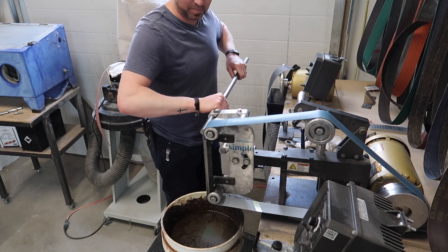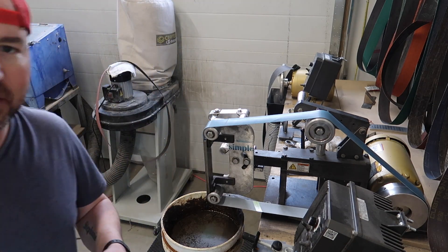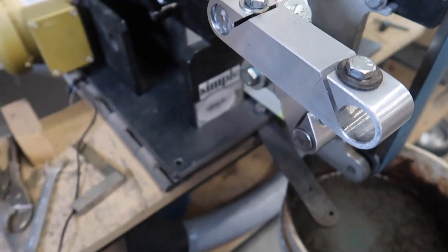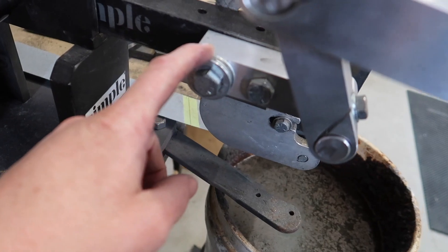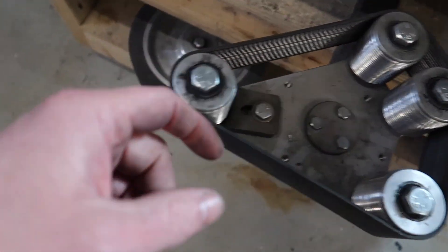It's really not all that much material and it's actually a really easy project - basically just drilling holes, tapping, and cutting. I wanted this to be a non-welding project. One thing I do want to figure out is a better way to attach it, because right now I've got these three-quarter inch bolt holes on the tooling arm for the flat platen, but when I get over to my radius platen, my rotary platen, or my small wheel holder, I don't have those same holes.